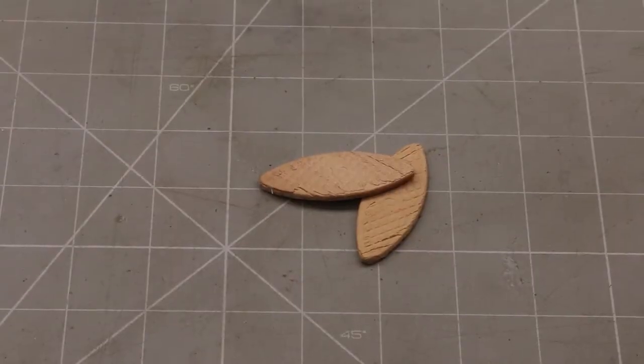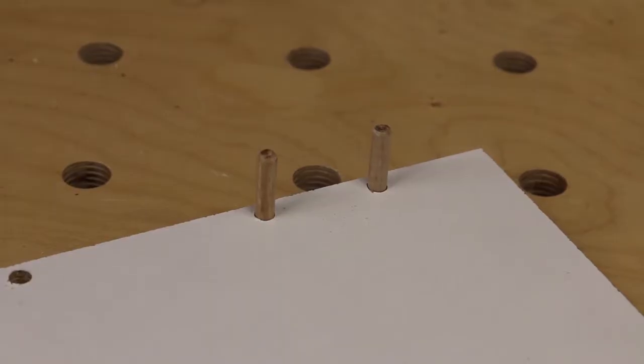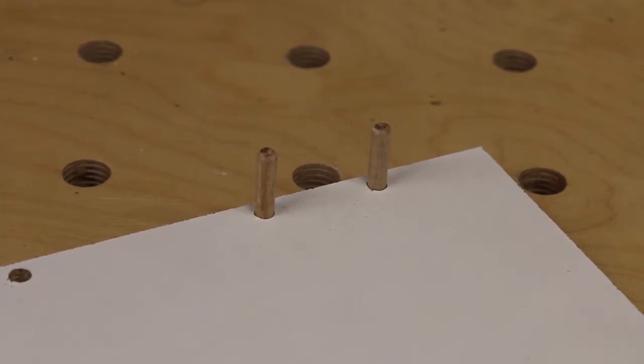Well, there's the biscuit, of course. But really, everything you could say about the Domino applies to the biscuit, plus it's not as strong. Then, of course, there's dowels. This is the go-to solution in industry. But there, of course, the holes are being made by CNC machine, so you know they're absolutely aligned. And that's a crucial issue. Alignment of dowels. To be clear, double doweling is the best engineering solution for most applications. It is just as strong, gives better location, and is much cheaper.